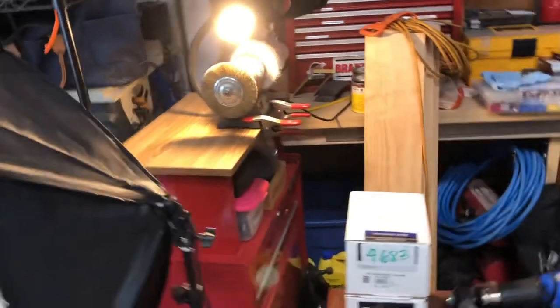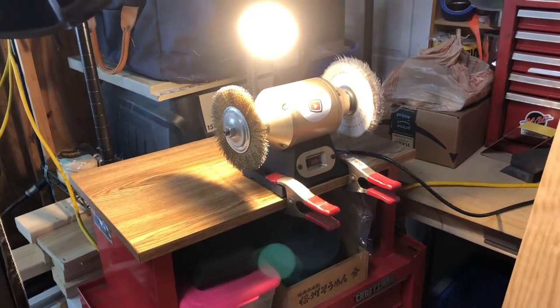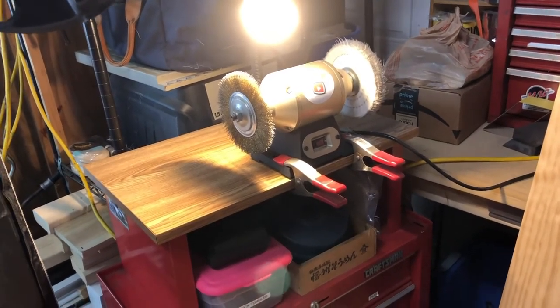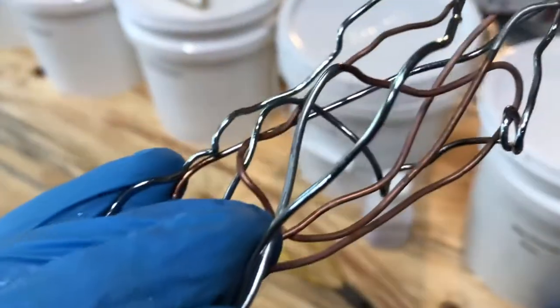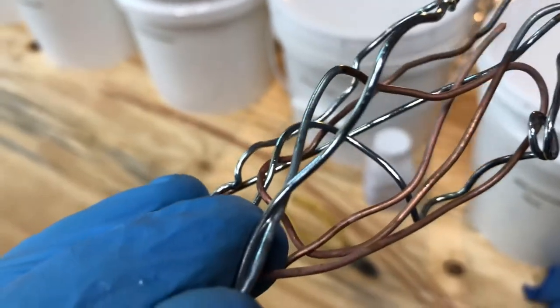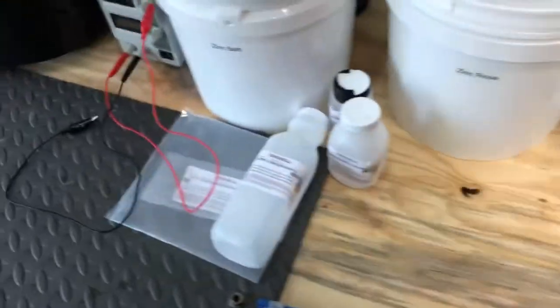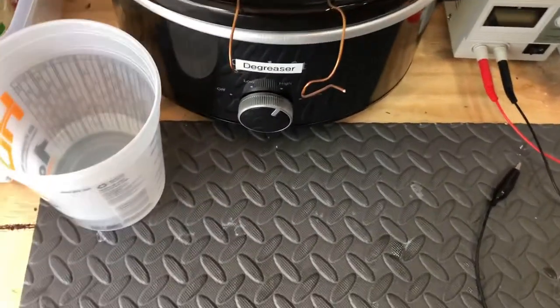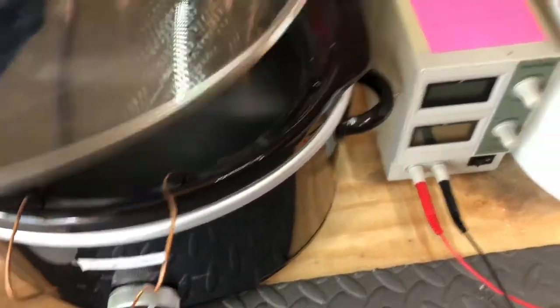Then I'll come over and hit it with the wire brush - I've got my grinder set up with a wire brass brush on it. I do that just to get it super clean and bring the metal back kind of shiny, because the amount of shine in your finished product is really based on the surface you start with. If you start with something really smooth, you'll end up really smooth and shiny. Once I come off that grinder with the wire brush, I'll drop it in the degreaser, which is running around 180 to 200 degrees.